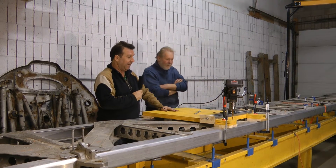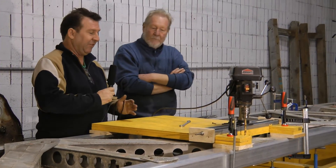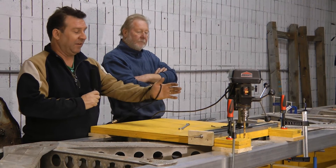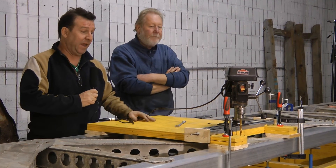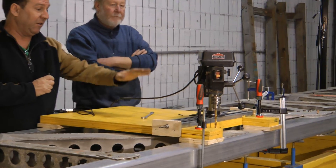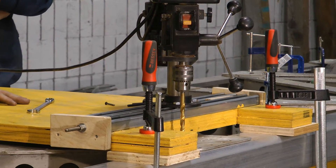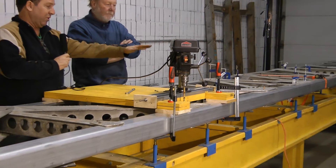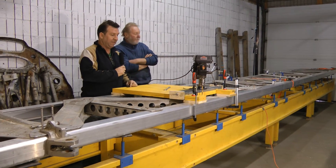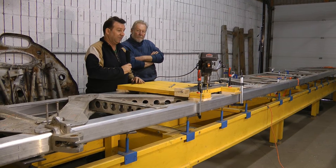On that theme, we've made a drill jig here, and we'll be sliding this jig along from station to station as we drill. We've made this out of an old drill press, and I think it'll be handy. Originally we were going to do all of the drilling by hand, but this will make a steady platform for our drill head, and our holes will be nice and perpendicular, saving us a lot of time.